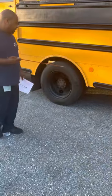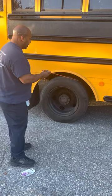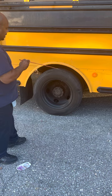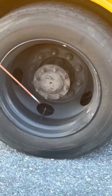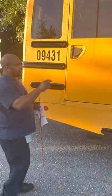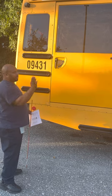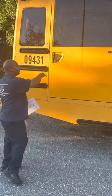Back here, I'll inspect the rear frame — tight and secure, properly mounted, with no illegal welds. The rear tires should have no less than 2/32nds of tread depth. I'll inspect the frame, suspension, brake, tire, and wheel assembly on this side the same as I did on that side. This is my axle hub — it has grease inside, so I want to make sure it's not leaking, it's tight and secure, and properly mounted. The wheelchair lift — the proper way of operating it is: with the vehicle running in neutral, activate the wheelchair lift switch, open the door, take the controls, lift the wheelchair out and down, lift it back up, fold it back in, make sure it's tight and secure, shut the door, and latch it.